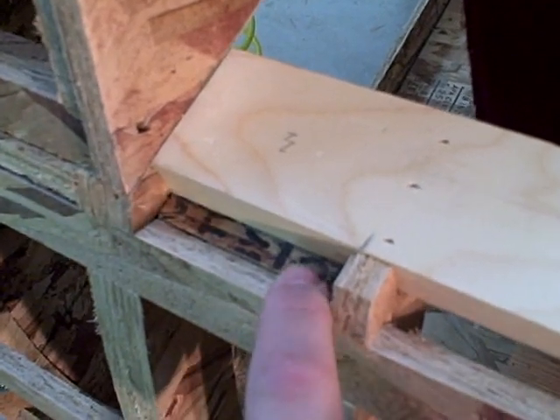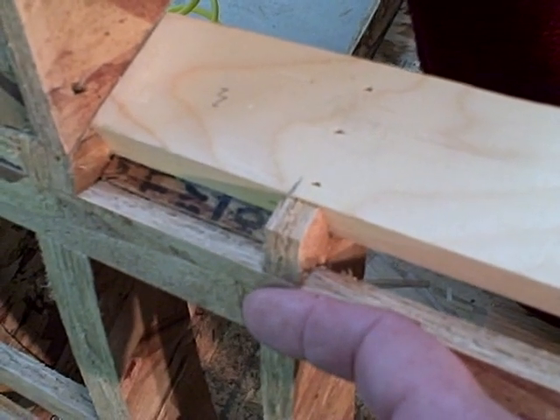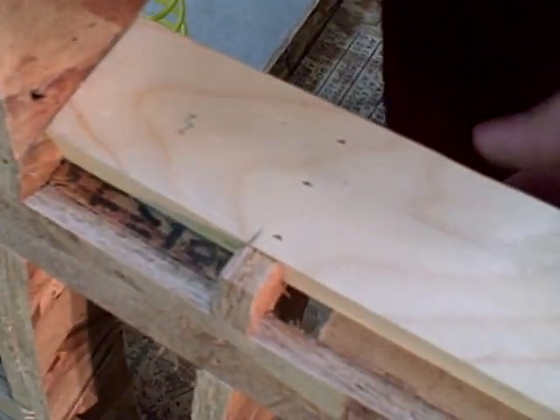Next we've got the construction detail I wanted to talk about. As you can see, there's a gap between the canopy rail and the surface where the skin is going to be. This gap needs to be closed up because we're going to have to put a line of either regular fasteners or rivets in here to hold the skin down. What I've done is put in a little bit of blocker material back there using a pin nailer. It's pinned and glued in place and it'll fit under here — you're going to have to do this for the entire run in order to build up that surface.